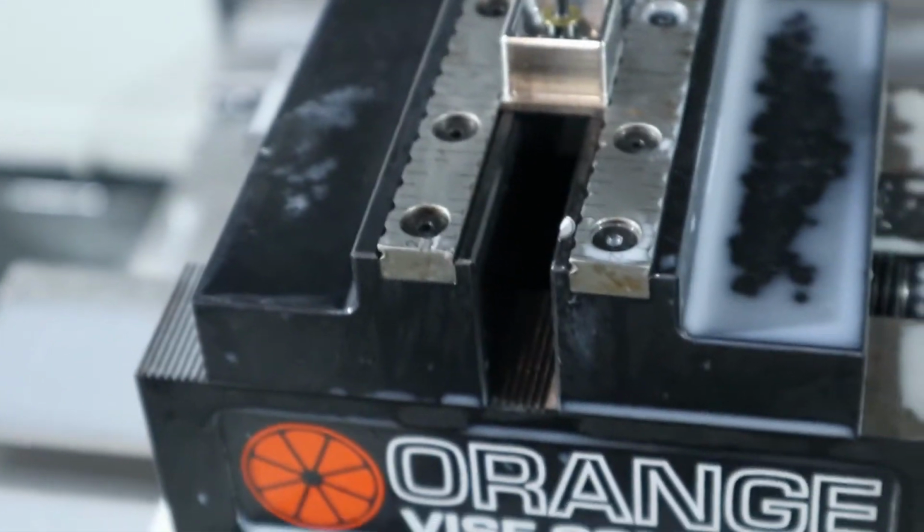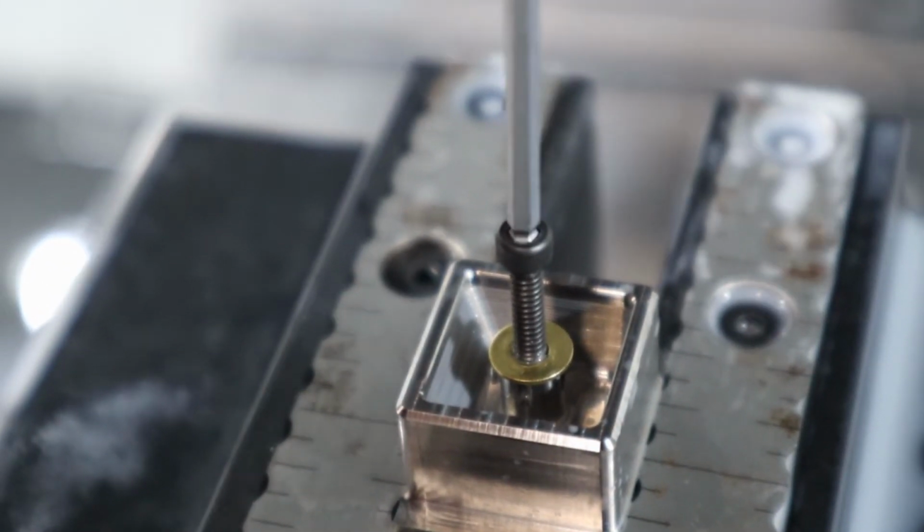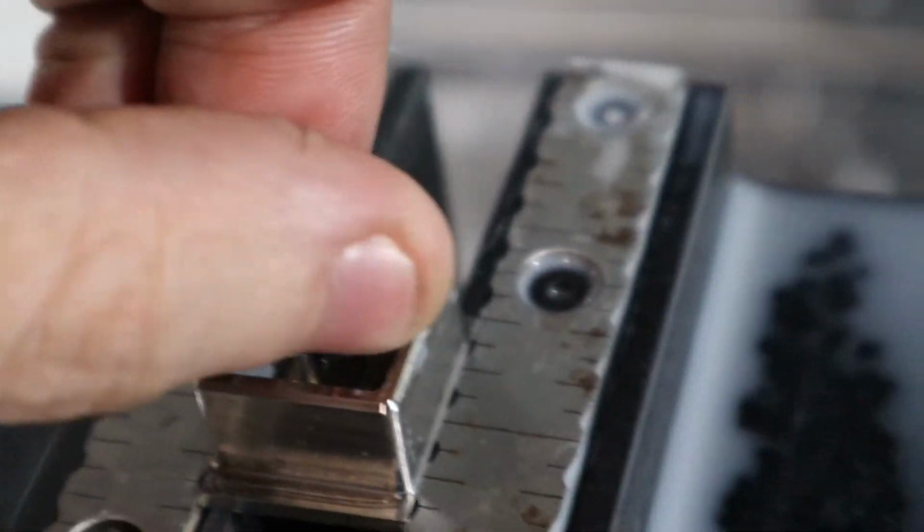I think with titanium, you can gall the titanium really easy, so you want to be careful about what I just did. Usually this is when you have a thing in your hand. Plus there's aluminum on the bolt, which is not a good practice. Let me try a different bolt.